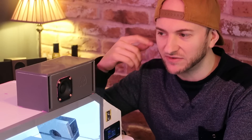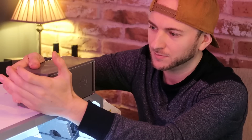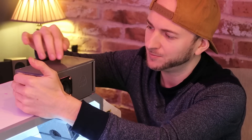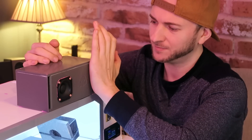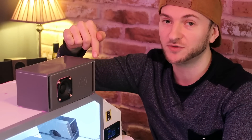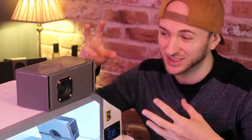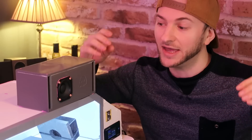At 360 Hz, not actually as clean as the 270 to my ear — there's some noise in there. Blocking the right-hand port gives a heavy reduction to output level and sounds a bit funky. Blocking the left-hand port gets a lot louder at 360, so it's probably using the left port mostly at this frequency — the right one becomes a bit of a hole, a bit of a hindrance. Much cleaner sine wave as soon as you block that one at 360. So this box is happiest at 33 and 45 scaled hertz. At 25 scaled, a little unloaded with some harmonics; at the higher frequency, again a little harmonic and a bit funky. But between those middle ones — around 33 to 45 scaled — it sounds wicked and well loaded.